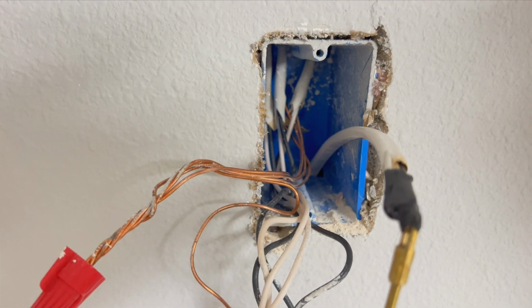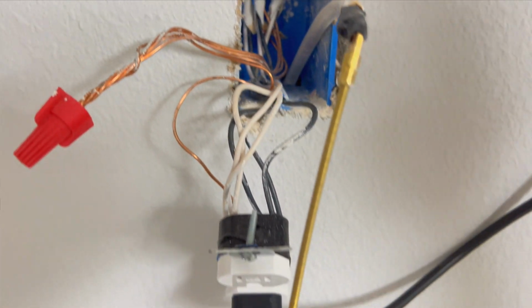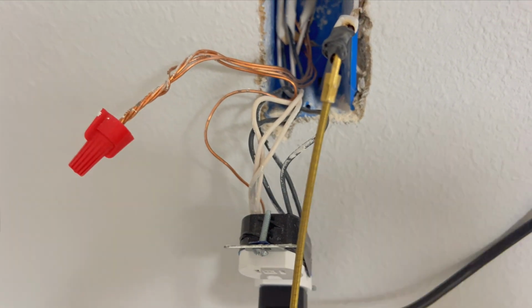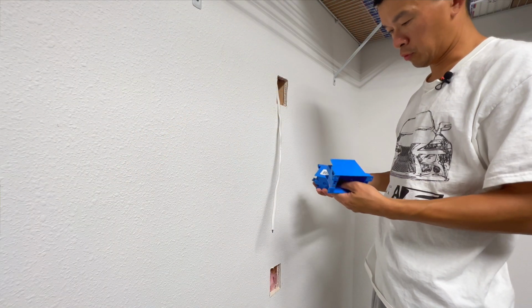I'm gonna go ahead and make all the wiring connections on the outside, and then we'll make this final connection to the rest of the circuit last, so that way we don't short anything out. So we'll end up putting all these old work boxes in.